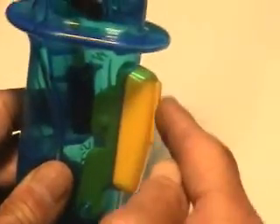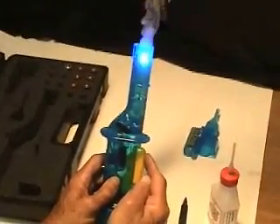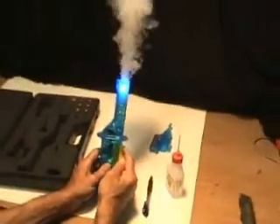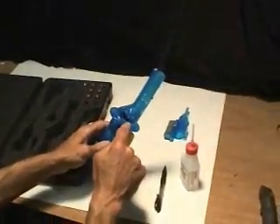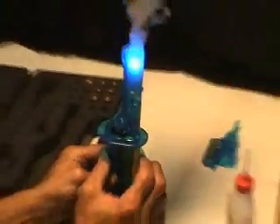Now this is how we operate it. You'll notice this is a two-part trigger. This is the vapor lever and this is the power lever. When you push in the power lever, you'll see the blue LED light indicating that power is on. You can see it heating up — it's a little electric heater in there that vaporizes the material. First you push it in for about six seconds, then push the rest of the way and you create a nice thick fog. Make sure there's fluid underneath the tube, and it's a good idea when starting up to have it tilted slightly forward.